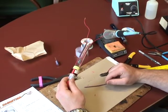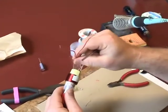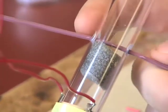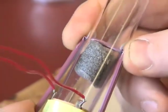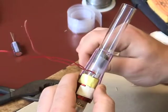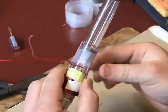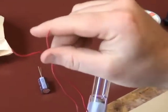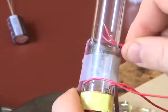We are now ready for step 9A. Locate the plastic straw and the clear plastic tube. Bend the red wires up away from the tube. Place the plastic straw through the quarter-inch holes in the clear plastic tube. Bend the straw towards the coil, making sure you make sharp bends. Take another piece of scotch tape and temporarily tape the straw to the plastic tube — this is only holding the straw down until we finally tape it at the end. For step 10, take the red wires and thread them through the hole closest to the solder lugs, inserting and feeding them through the clear plastic tube and out the open end.